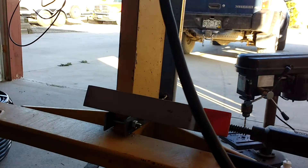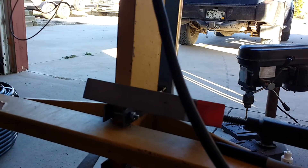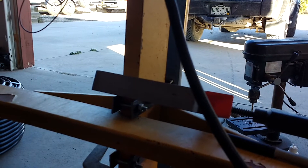I'm going to lay it over because I'm a better sideways welder than a vertical welder, just to make sure I get a good solid weld on all of them. Then I'm probably going to weld them on the inside as well, just to try to get a little extra strength.